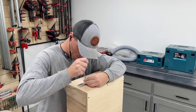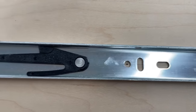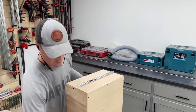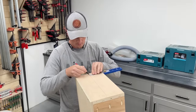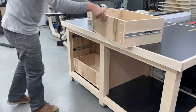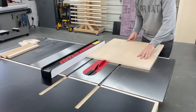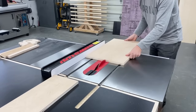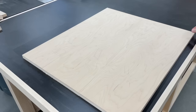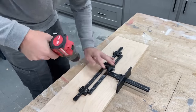Something I've been doing a lot is using an awl for attaching drawer slides: with tiny screws in soft plywood there's no need to pre-drill — just use the awl to make a starter hole right where you want it, super accurate, and nothing shifts. For the drawer front, it's nice to plan ahead and consider grain direction flowing from piece to piece — I'm the one in here working and looking at this thing all day, and little things like that just make me happy.